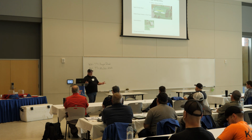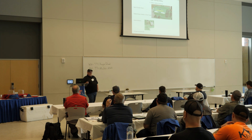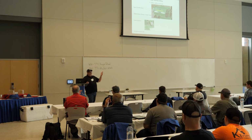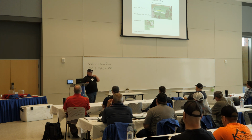I've been guilty of going over the casing. I would never climb over a master pusher. I mean, it's just scary. This thing's traveling out here. You don't know what gear it's in. Doesn't matter what gear it's in, it's still going to pull you in. Never set your ladders up close to where that barrel is when you do your pit setup.